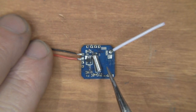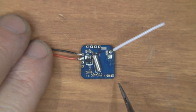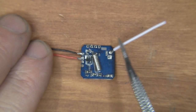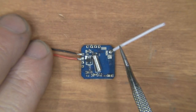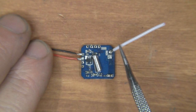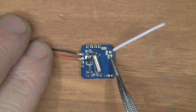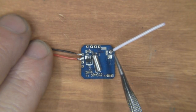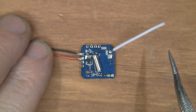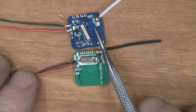You can actually block all 12 channels on a standard Wi-Fi router by using four of these in conjunction with each other, just using different jumper wires to select the different channels. The little antenna is a monopole — a piece of wire soldered onto this solder point here. One of the things you can do is add a proper antenna and use this pad here as a ground plane, and just doing that actually extends the range of this little AV transmitter.